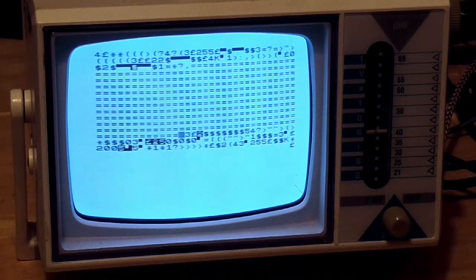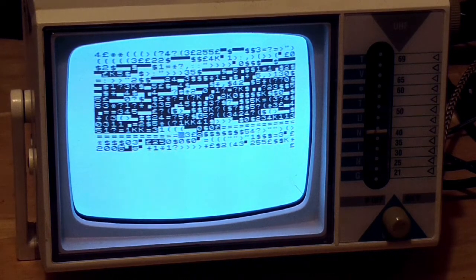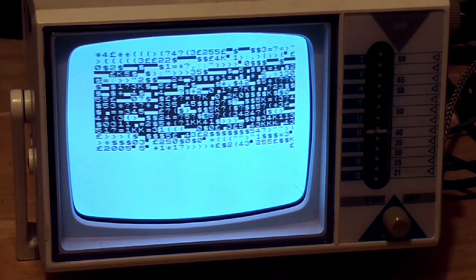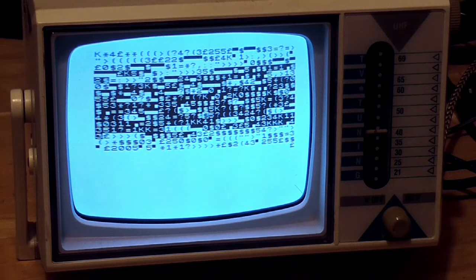In the previous video, we got as far as having a 5 volt to 3.3 volt interface that allowed the Pico to read signals on the ZX81 expansion port, but I hadn't got as far as allowing the Pico to send data back to the ZX81. This turned out to be quite a frustrating task for this week, but also, in some respects, easier than I thought. The difficult part was learning how to do this with the quite limited PIO commands on the Pico. And the easy part was that the potential divider of the pair of resistors will work quite well.